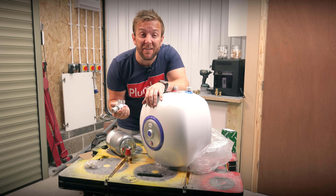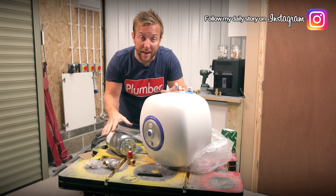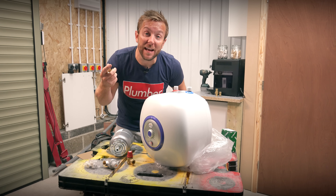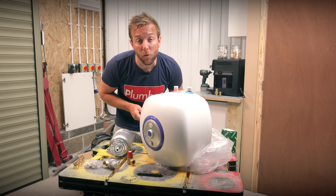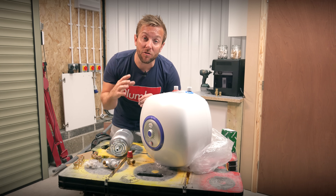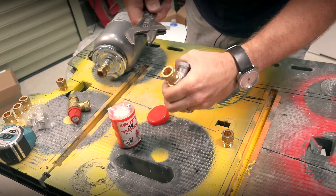Because I've done a water pressure test here and I know it gets up to about seven bar at night, I'm going to be fitting a Caleffi pressure reducing valve. They haven't supplied the irons, so you need to go out and get them. You'll need three female irons to 15mm and three male irons to 15mm. I'm going to make up all the fittings now using Loctite, then we'll go to the under-sink area and I'll talk schematically about what we're going to do.